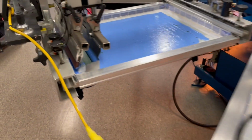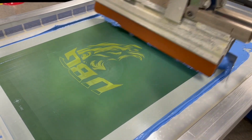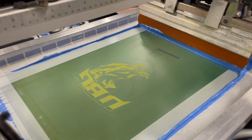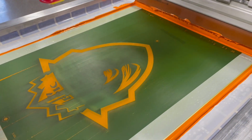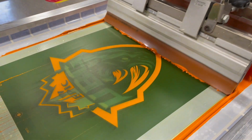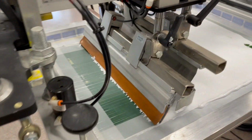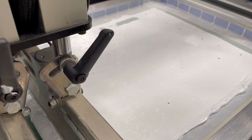After the flash, we come back with the colors. This is the Epic Mixing Base in PCs, 2381C, printing with very low pressure through a 280 mesh. See, it comes out smoothly. And then a 151C Epic Mixing Base with PCs. And again, very nice. After the color, we flash it, and we follow it up with the final white, sprint white through a 180 mesh.